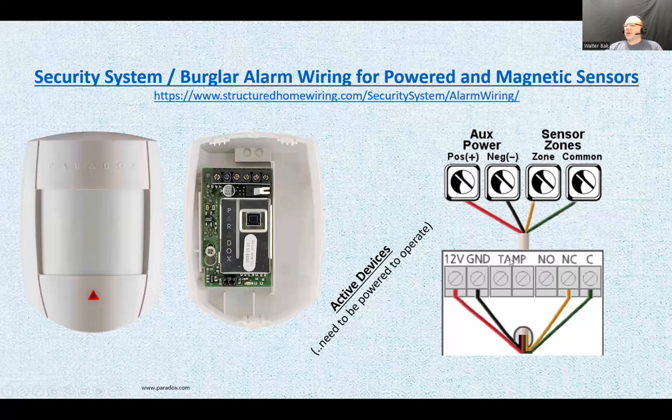And there are those two other ones. That's a tamper switch. You can wire that tamper in series with this loop. Here's a switch. There's a tamper switch. When you put the housing onto that, the tamper switch is closed. If somebody wants to tamper with the device, they will have to take the cover off. They're going to release the switch and the system is going to react.